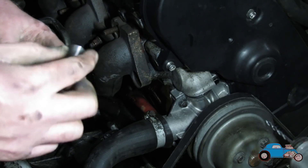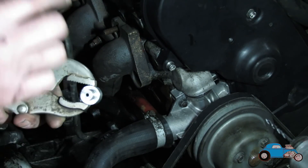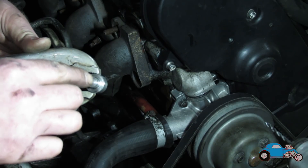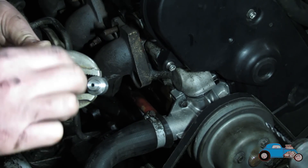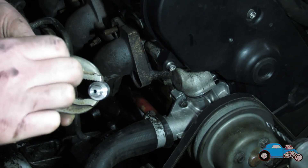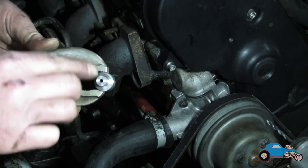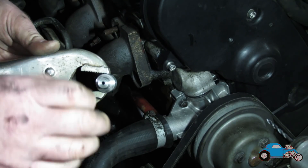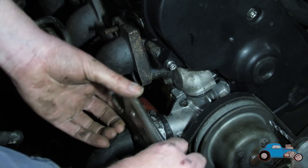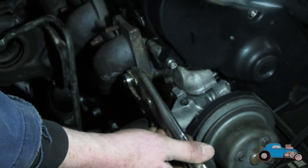Beth has just machined up a small little collar. This size here is the same size as the hole in the manifold, and that's to get the hole dead central in the stud that we're taking out. We're going to drill a 3mm pilot hole all the way through it, nice and central. The reason for it being central is, if we can't use an easy out, then we can keep drilling and eventually use a tap to clean out the thread — that will take out any last little bits. If you don't drill central to the bolt, you can't keep going up sizes of drill bits, because you'll end up being over too far and taking out some of your thread, which makes the thread useless. Beth's going to hold the collar in place and we're going to try and get a 3mm drill to go down it.